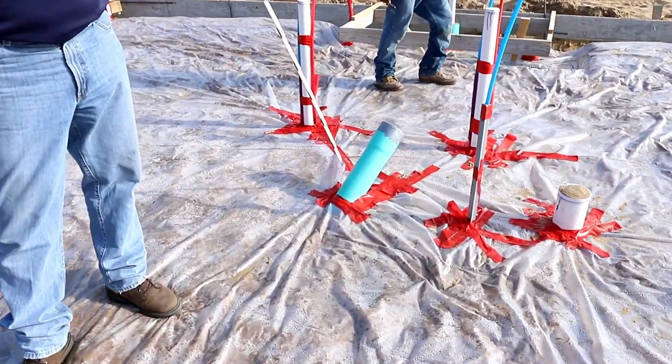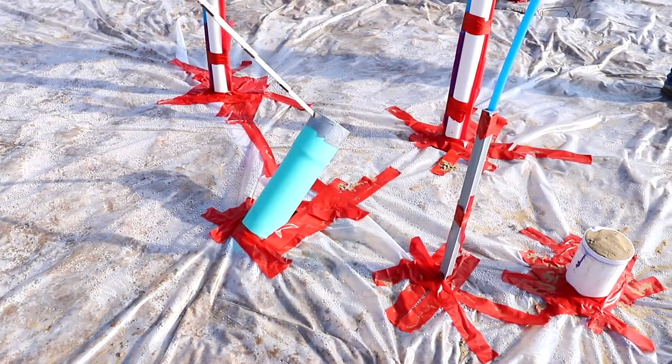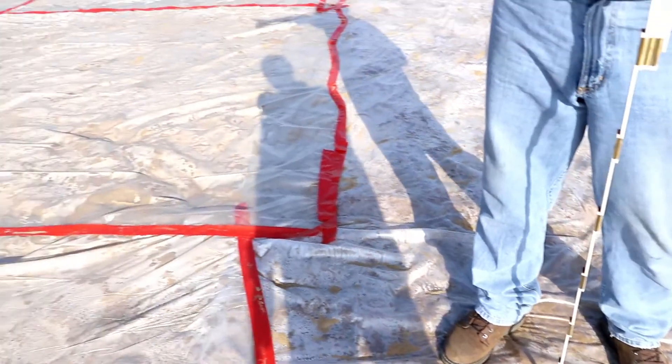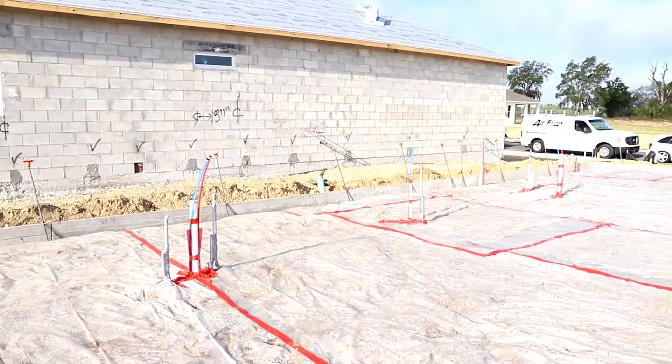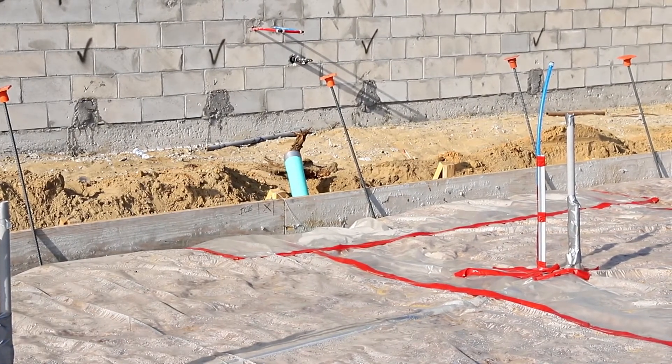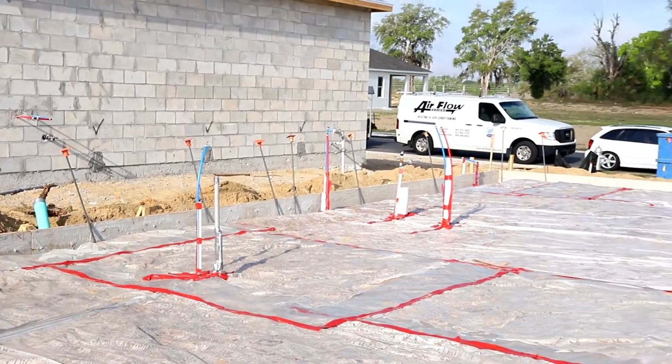This is the case for the refrigerant lines. This is where the air handler is going to be located. The other end of this is on the opposite side of the house — that's about a 50-foot length of run. It would make more sense to have the outdoor unit installed on that opposite side so we'd only have a refrigerant run of maybe 15 feet. That's the difference between production builders and custom builders — production builders don't always think ahead for efficiency. It's on the wrong side of the house in my opinion, which is more of an efficiency issue than a code issue.